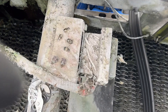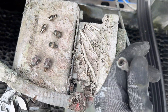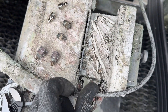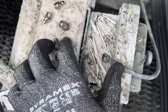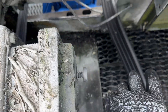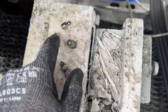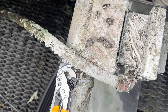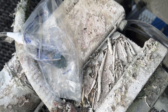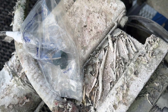One thing I'm doing here is making sure that the grease lines and everything are in good shape. This is like a compression fitting and then the zerk goes on there, and that holds in between this plate. I'm going to replace some and reuse others, but I'm going to flush the lines out with fresh grease. Washing out these lines now — fresh grease in there.